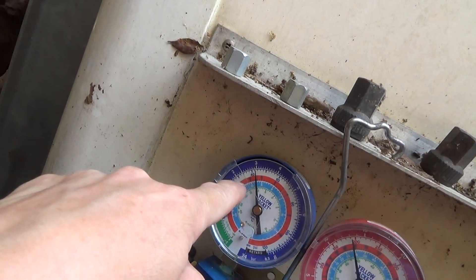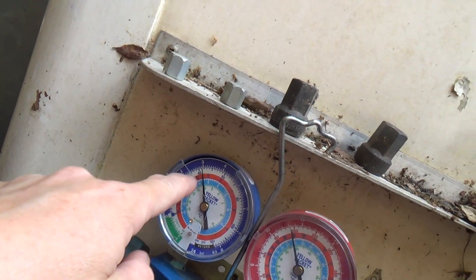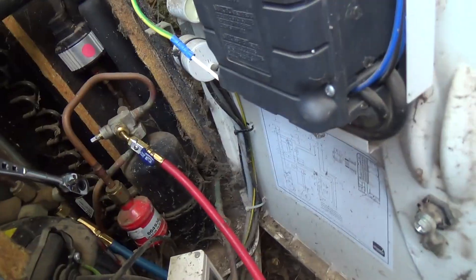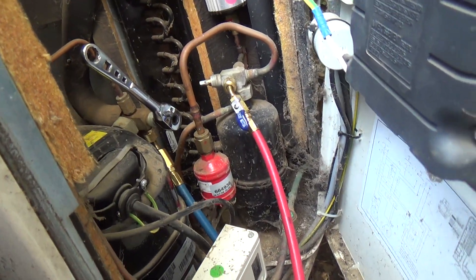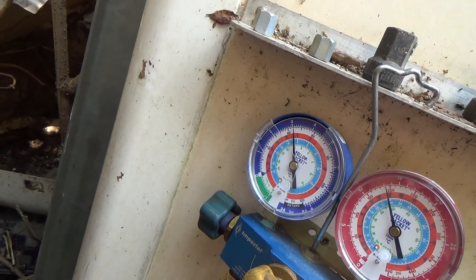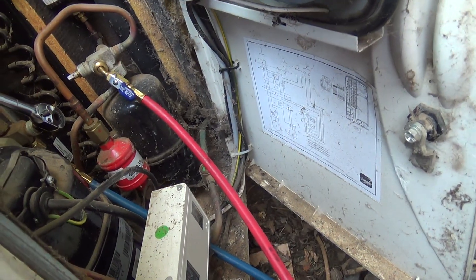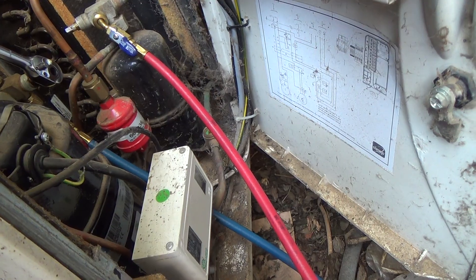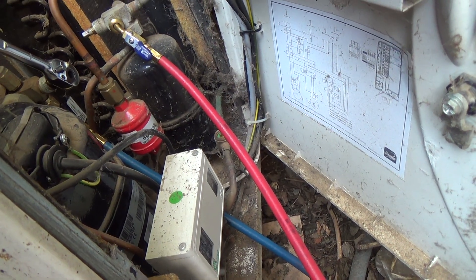Mixing PSI and bar - we had about 40-45 PSI on the low side and 400-something on the high side. So we've got too much liquid in this and it's completely filled the condenser and went off on the high HP. The LP is switching off too soon as well, so it's limiting the amount of duty it can do. Plus it's overcharged.